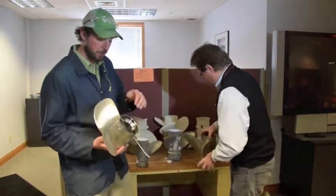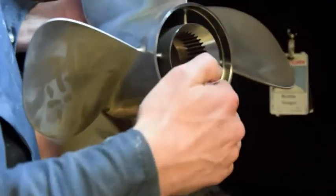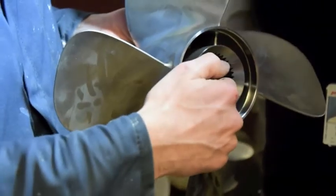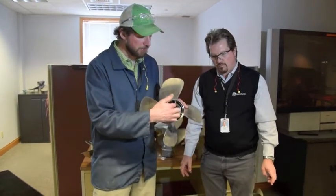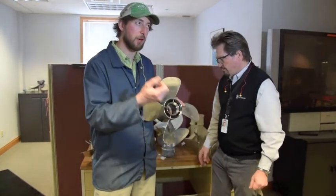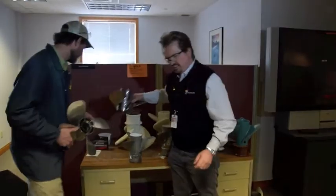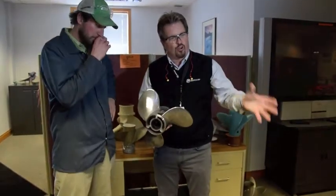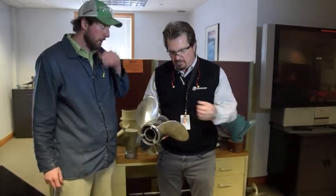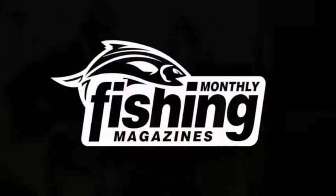This one's been sanded, and you'll see we machined the labyrinth seal — either receiver or male labyrinth seal — and then some propellers get splines. If you can see that, we'll machine the receiver and then pull a broach bar through that's got the spline profile on it. The end result is the famous Mercury propeller — it's about acceleration, speed, and giving that customer fuel economy. All done up here in Fond du Lac, Wisconsin.